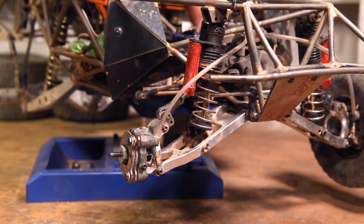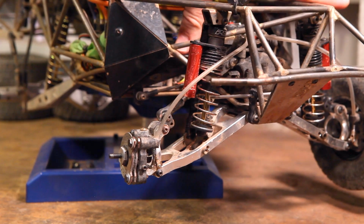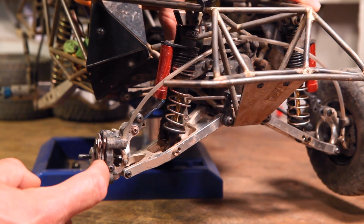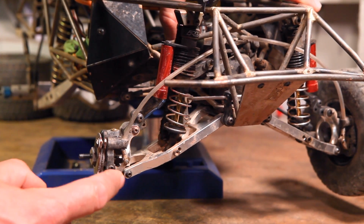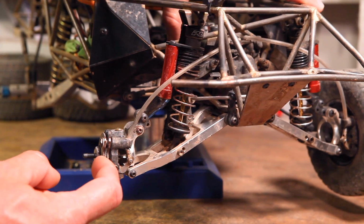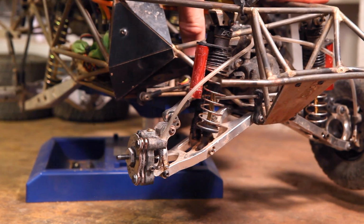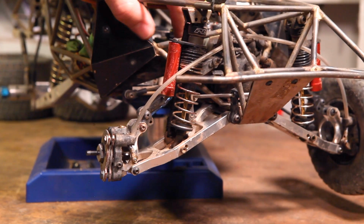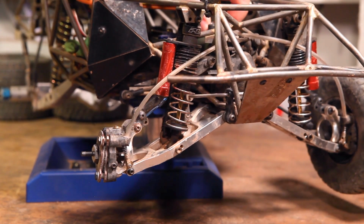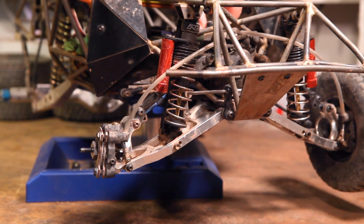So just to get a general idea, I'm going to press on my servo arm here, and you can see the functionality of the little arm here that presses on the disc. So back in here, you can see where the pivot point is, and as this is pulled up, it presses on the back brake pad, which then presses against the disc, which presses against the front brake pad, is what I meant to say, brake pad, not brake disc. And again, that happens on both sides, obviously, and I have some fine adjusting and coarse adjusting screws up here on the top, next to where the two cables come together.